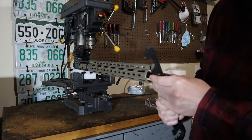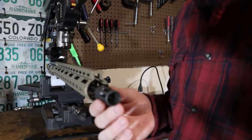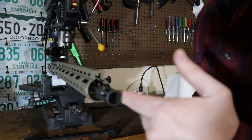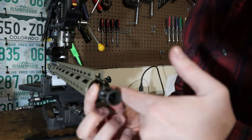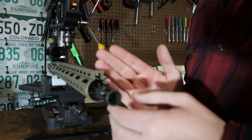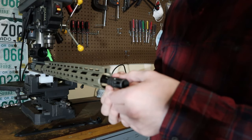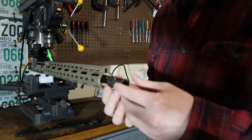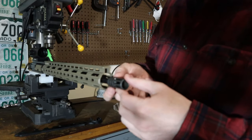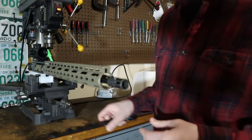I go my quarter turn. You can see now that it's actually not timed properly — the solid portion is over here facing this side, so I need to turn it further. You need to do at least a quarter turn because that's what gives you the 20-25 foot-pound pressure the device needs to be set to. To get timed correctly, you may have to pre-crush the washer: tighten it, back it off a little, tighten it, back it off a little, until you can get it timed. Your last tightening, though — you don't want to back off from there. You want your last quarter turn to line your device up with the orientation it was designed to be.